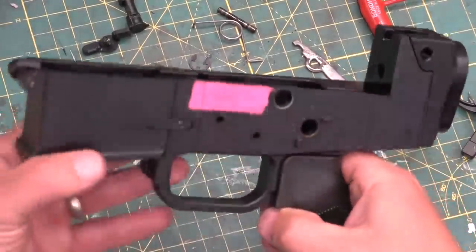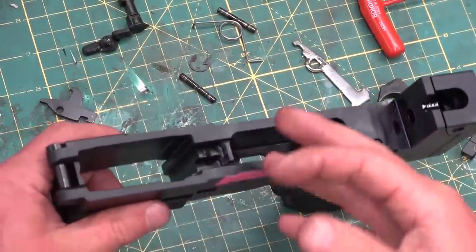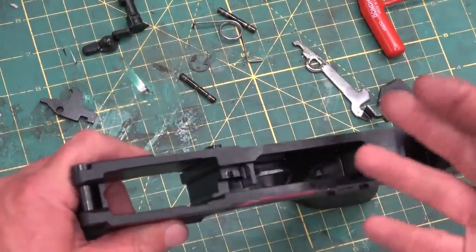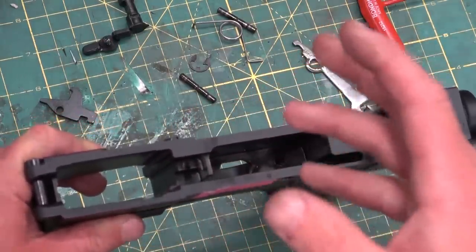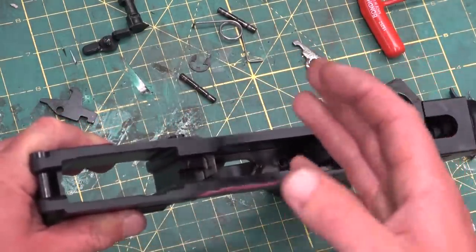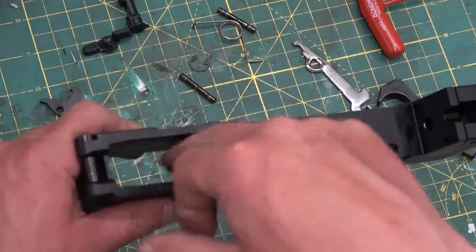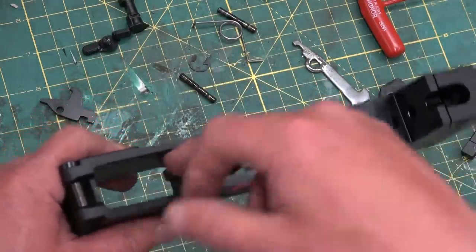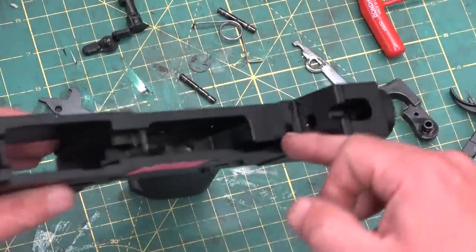Into the lower, the Glock-style magazine well. You see the mechanism there. The machining of this, I don't know if it's done in-house or subbed or offshored or what, but they've allowed the machine tool time to do its work. They're not pushing anything. You see this long, thin cross-section, very apt to rattle and chatter, especially with the long, thin end flapping in the breeze.